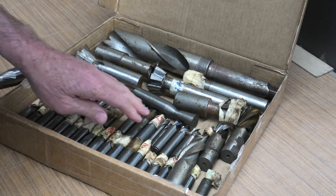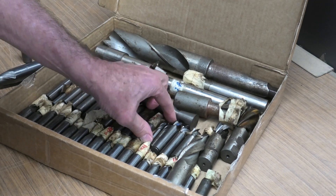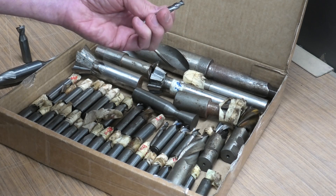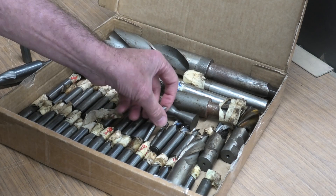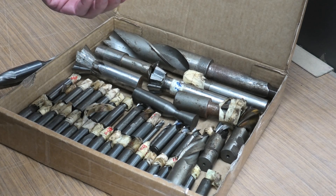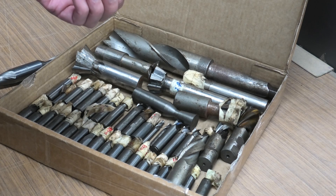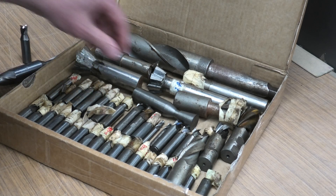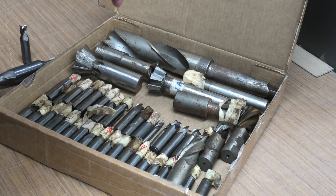I think there's about 40 of these carbide cutters, ranging from very tiny - that's more like a counter bore, it's a two-diameter cutter - and also very, very heavy. So I'd say it's a micro-grained or micro-fine carbide. I've had some product like this made by Seiko many years ago, and you can't grind it with a silicon carbide grain grinding wheel, it's just so damn hard. There's another blank, not done yet - I'll be able to repurpose that I'm sure. They've been cut off a little bit rough - cut off most of the way and then broken.